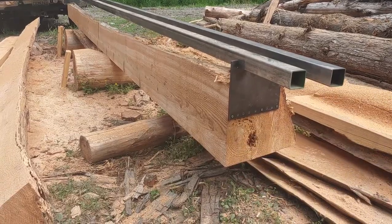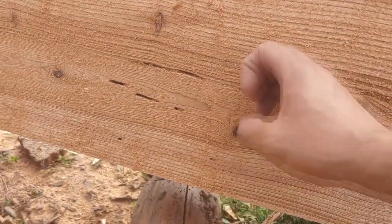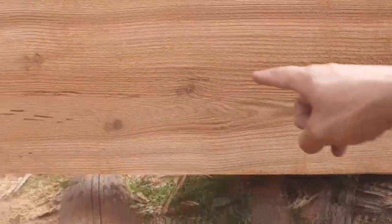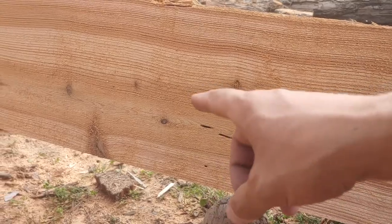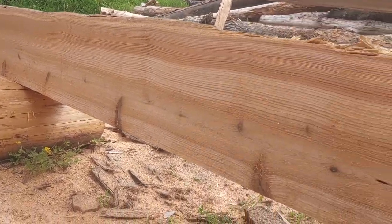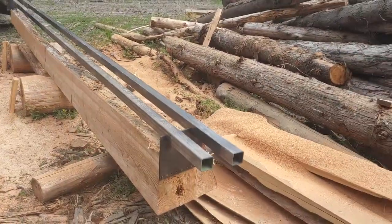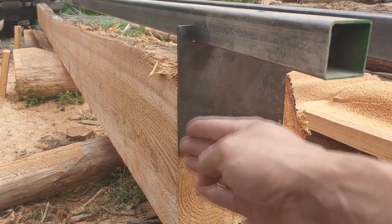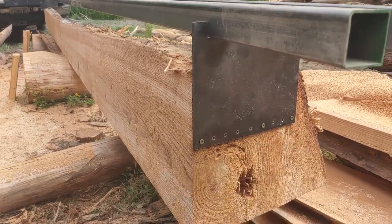We just finished our second cut. I'm set up for the third cut. I noticed we've got some wormy bug damage going on even in the heartwood. I knew we had some rot at the butt, but I don't know how far the bugs get in — I don't see any trails past about three feet in. So we might have to sacrifice some of this to get out of the bugs, but we've still got lots of good wood. One tip: when I set up my jigs I like to be flush or a little bit in from the face, so when I start cutting I can just go straight down the log without bumping around the plate.